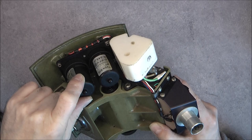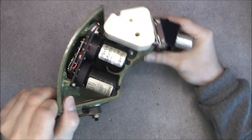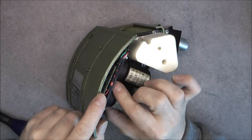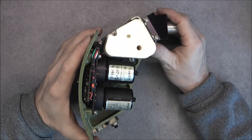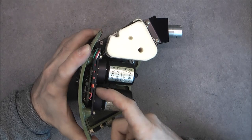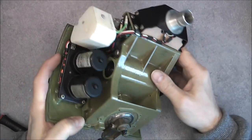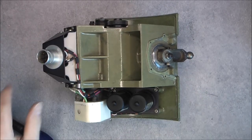Just a few wires going inside, same for this module here which is directly connected to the motor brushes - maybe some kind of filter for the motor. We have two relays that will obviously control the motor on reverse polarity. Very nice relays, but the rings to attach them are really tight and I do not want to damage them. I will undo this part to show you the actual mechanism inside, but first I will try to power it up.